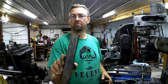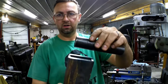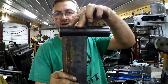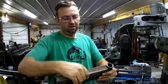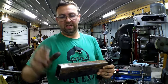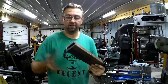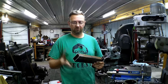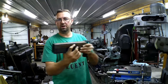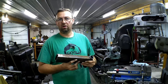What I just did there was mill a notch in there for our tube to sit down in nice and perfect. Then it'll all get welded together — one side gets the tube and the other side gets the stud going into the base. I can actually take this arm off and just use the base and the crane arm itself. That's the whole idea — this will give you a little more travel moving it around, but if I don't need it I can take it right off and use it as just the crane.